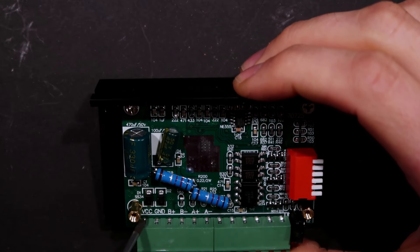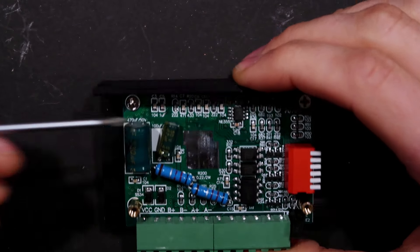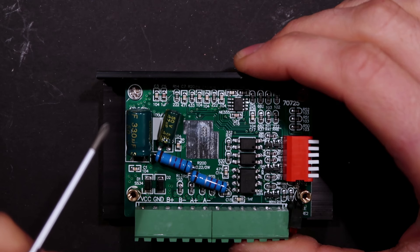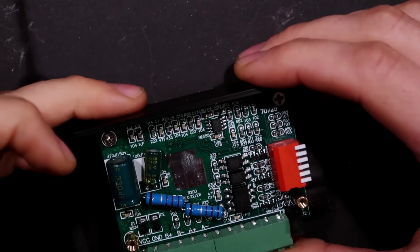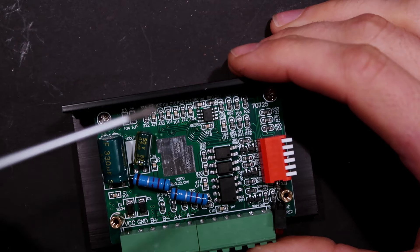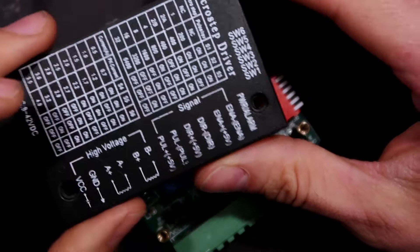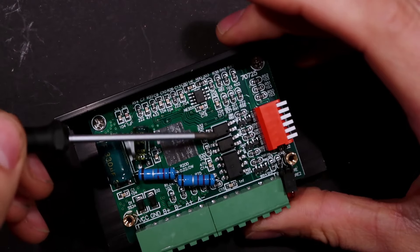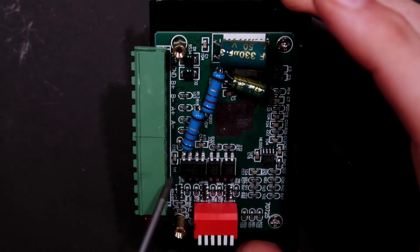If we follow the circuit: voltage and ground come in here, labeled VCC and GND. There are some kind of reverse polarity diodes, then some big buffer caps. There are two power resistors — probably to measure the current, since you can set the currents on this thing. There's a 555 timer, interestingly enough. This little section with all the IO — the enable, direction, and pulse inputs — they look like optocouplers.